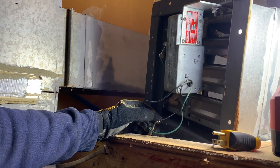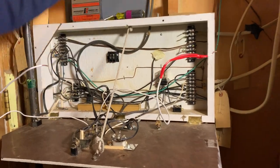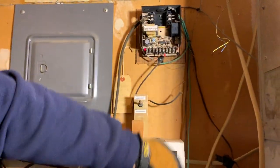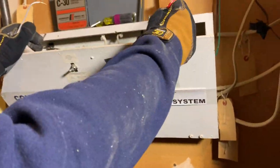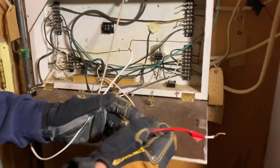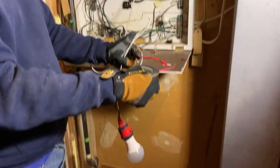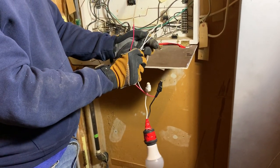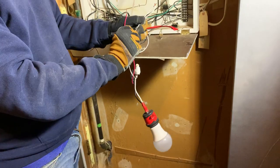I'm trying to diagnose things like this damper motor — I'm only getting eight and a half volts up here. When I finally did get power, I came in and found that the power comes to this strip, he's plugging into here, and this is dead. It back-fed, and look — there's an arc mark where it blew up that little water pump out of the water heater. I made my own test lead, turned that on, and now I've got power. A lot of you are scared to use a light bulb. He used power as his neutral — basically switched every neutral in here — and I think what he did wrong is he never added up all his neutral loads.